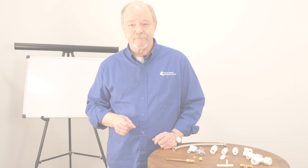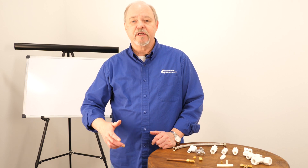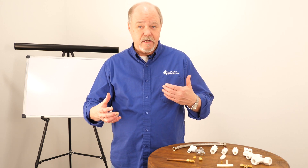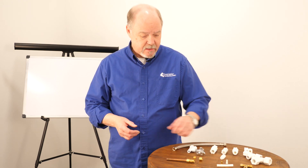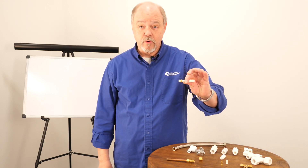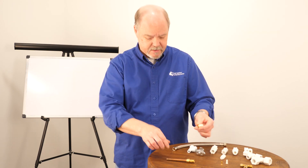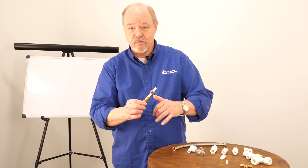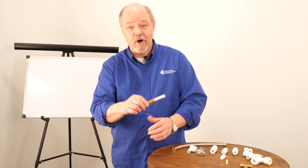Next, compression fittings. A compression fitting is just like its title — it works by compressing a component of the fitting into another component to create a watertight seal. The standard unit is a sleeve that goes onto the tubing, and it comprises a nut that does the compressing and the connection, which is how it connects to another tube or piece of equipment. The compression happens when the nut gets tightened down on the fitting.